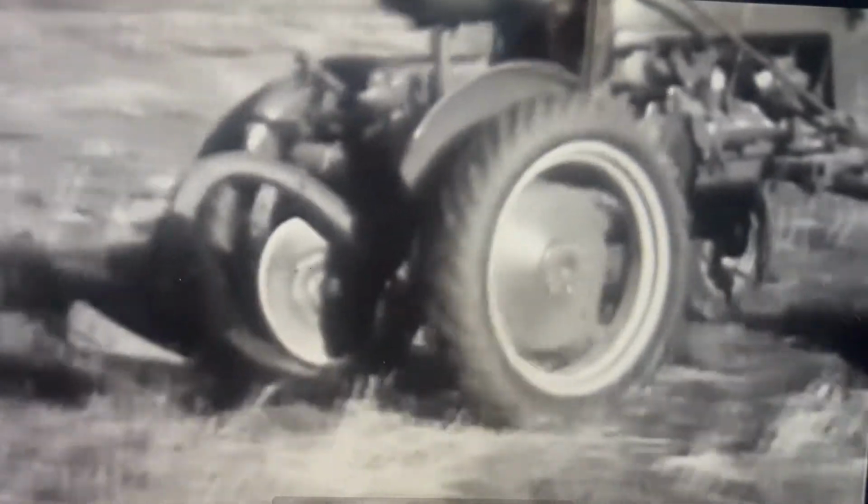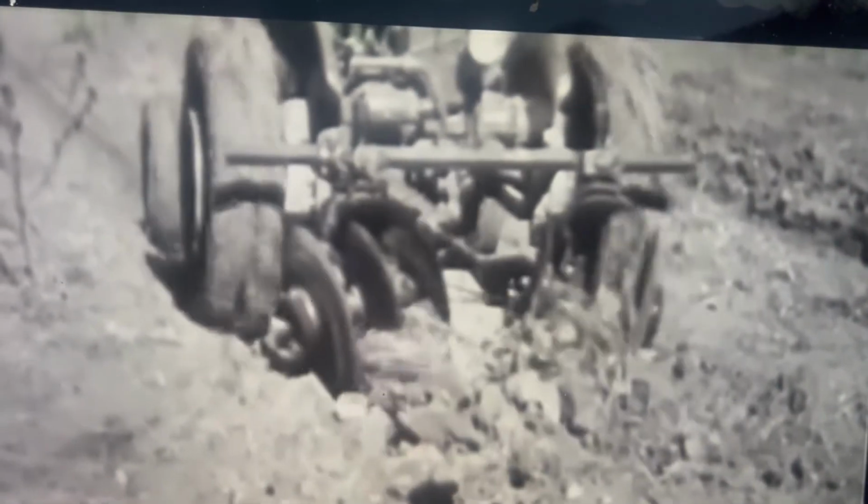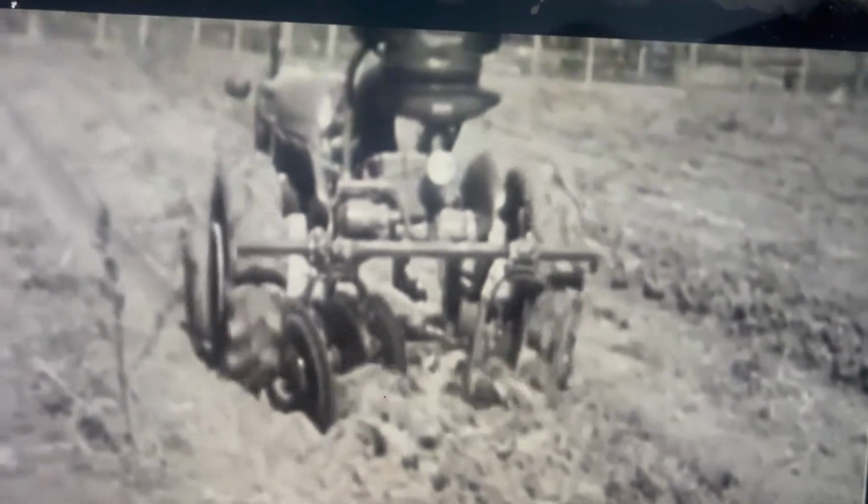The moldboard plow mounted on the drawbar is one of several tools for soil preparation. There's also a two-way moldboard plow for turning soil uphill on contour plowing. The disc plow that is widely used in many sections of the country. The harrow plow for lighter soil preparation and for covering a larger acreage. The middle buster, a favorite tool on southern farms. Rear-mounted implements are raised and lowered by touch control through the rear rock shaft, building beds with the disc bedder so the crop will be higher and safer from damage by excessive moisture.